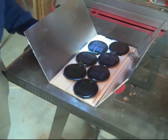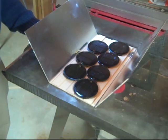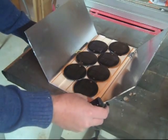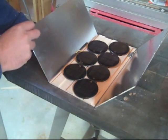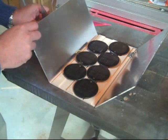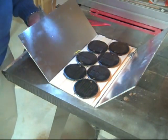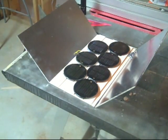The basic idea is that on low light days these reflectors would be set at 60 degrees and the whole thing would be pointed towards the sun. The total dimension from one end to the other is about 13 inches versus 6 inches for just the panel itself, so we're going to be pulling in roughly twice the amount of sunlight — give or take, since the reflectors aren't perfect and I'm not using mirrors. As the panel gets hotter, the controller would reduce the angle to 45 degrees, and at that point the light is directed over the panels and reflected back out, so they're only receiving incident light directly from the sun. That's what you do in high heat situations.